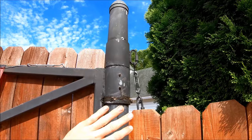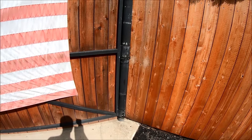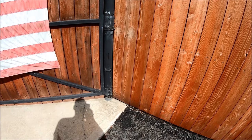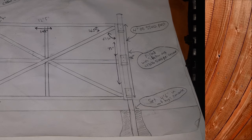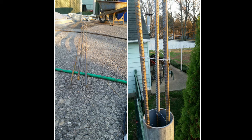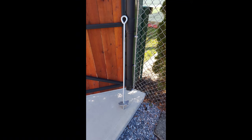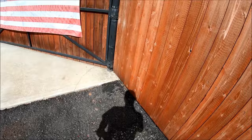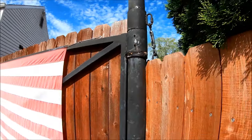Let's start on the load post. This is a four-inch SS40 post — very similar to Schedule 40, but it's actually an alloy — and it's sunk in the ground a whopping four foot six inches with six bags of concrete. This post is reinforced with three rebars inside and 5,000 PSI concrete. It also has a tension cable on this side that goes straight down to a helical rod about a foot off the property line. So if this thing ever did start sagging, I've got a turnbuckle here to pull it back — though that was never a problem.